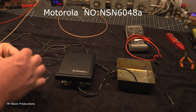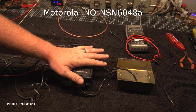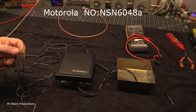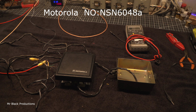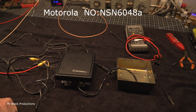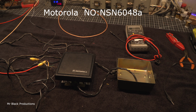This is your remote on. Now for my fellow brethren out there that are running a little bit of high voltage or high output setups, and you're afraid about RF getting into the amp section of this and causing feedback, with a relay, you can simply, when you key the mic, shut the speaker off. No sound. No noise comes from the speaker. That is out of the enclosure. That's how loud this is.